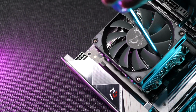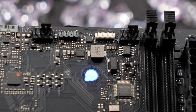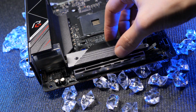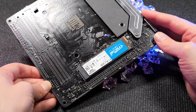Speaking of money, ASRock's boards are very well priced and the quality is great, as well as the little things. It has plenty of fan headers, 2 different LED controllers, and low-profile heatsinks for good aftermarket cooler support. The standout goodie is the primary M.2 slot is actually PCIe 4.0 4X. Plus, there's a bonus NVMe M.2 slot on the back, which also supports SATA.